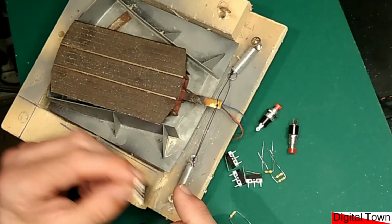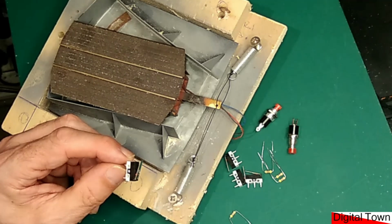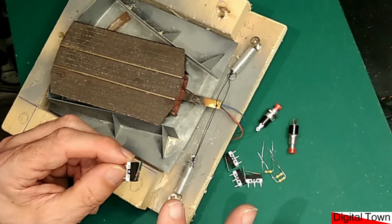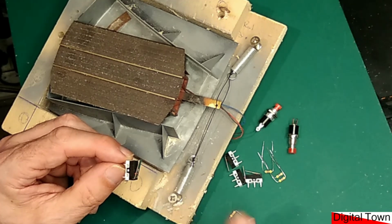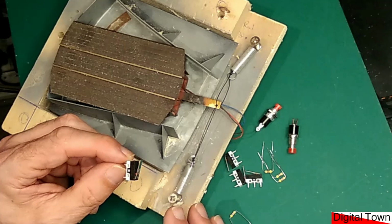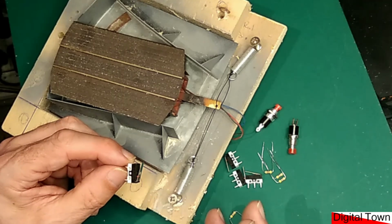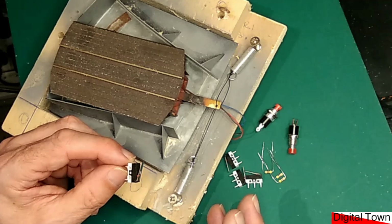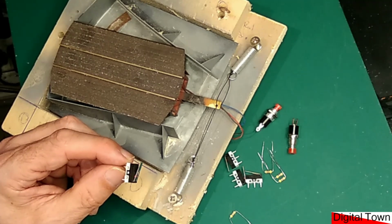I've got a machine that I've built for my son that puts plaster into bags. That has a foot switch on it, and again that has a pull down resistor to make sure that you have to press the switch and power has to go through the switch. So if you like, the line has to go high for the machine to run. So if we were to damage the wire, it wouldn't make any difference. The machine just wouldn't work.